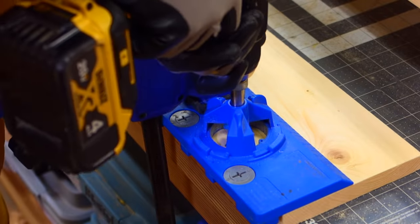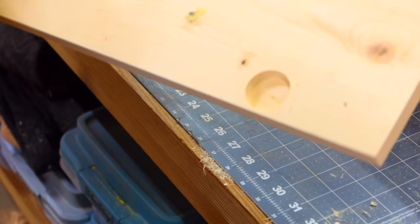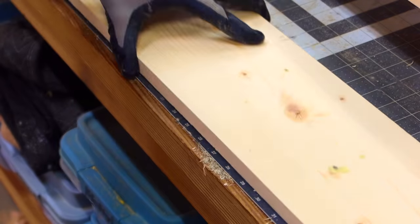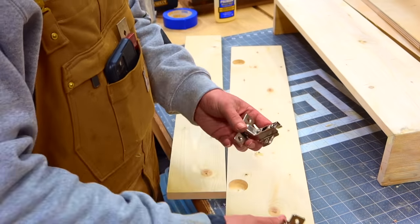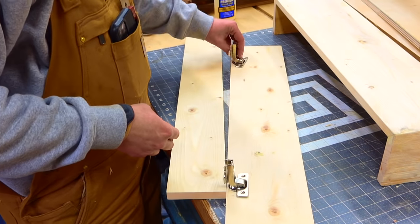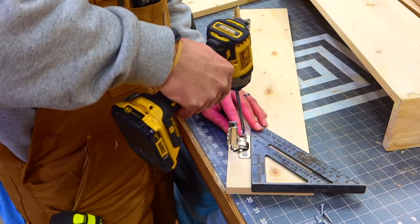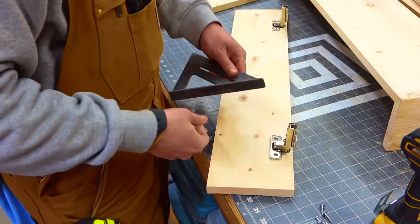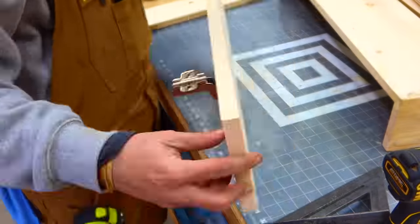Now it's time to use our bottom board — this is our square stock. I'm going to be putting in the hinge pockets: four inches in and about an eighth up. If you're using this jig, you can set it on the three-millimeter butt — that's about an eighth up — and again, four inches in on both sides. Let's go ahead and install the inset hinges into the backboard. I'll throw a link in the description for these hinges; they work perfectly for this application.